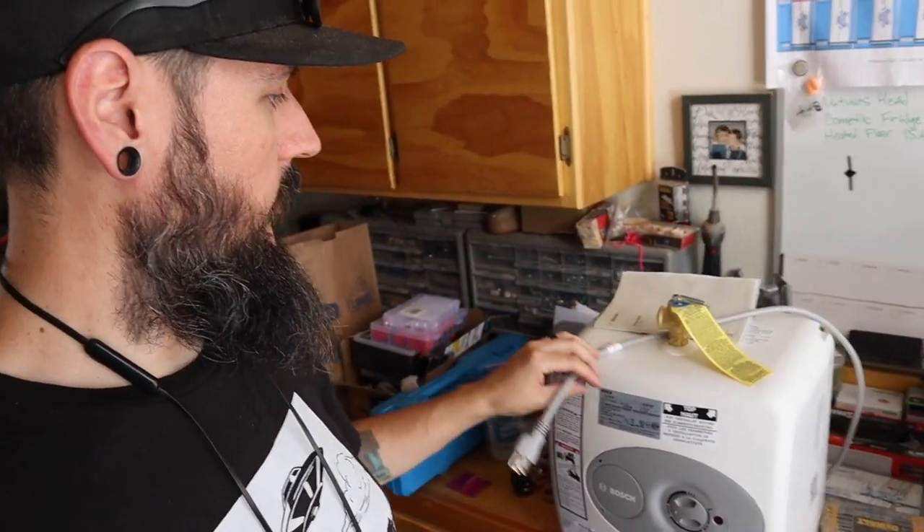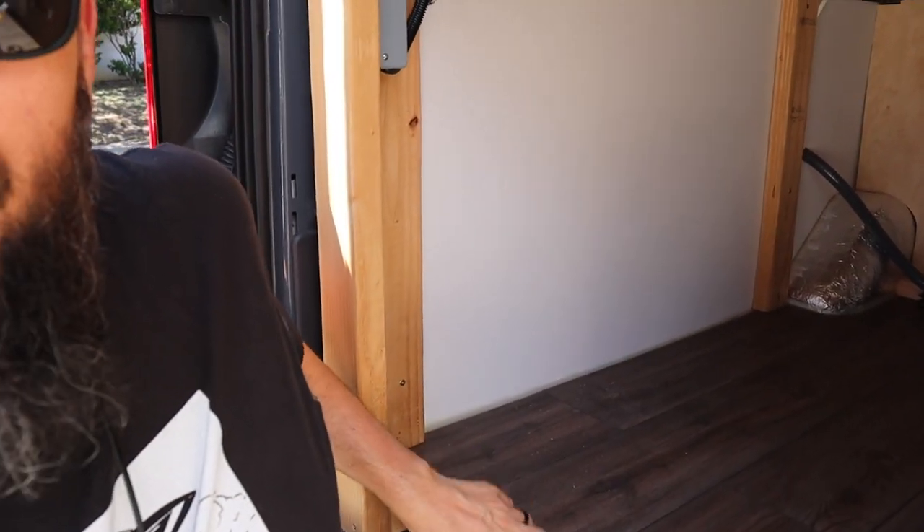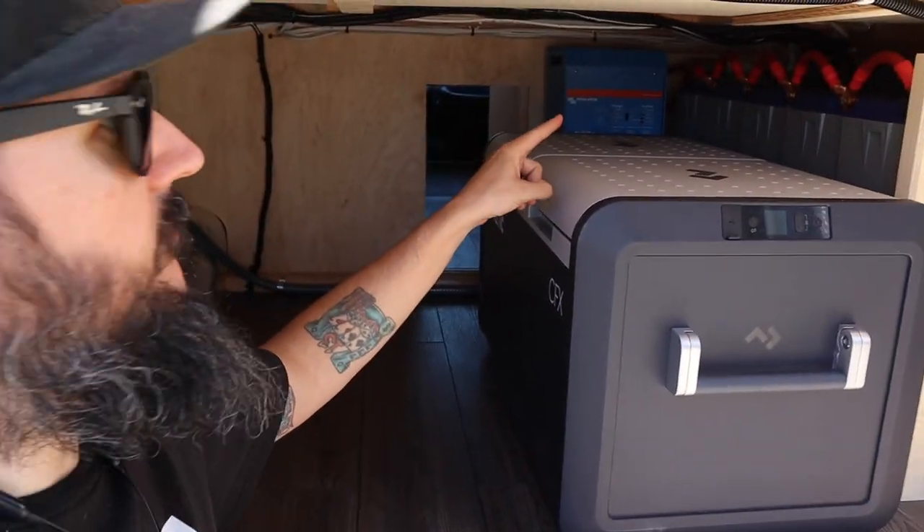The four and two and a half gallon models use a standard outlet. I've already run the wire and have a breaker for it in the van, so I just need to run the outlet to the corner where it'll be plugged in. The eight gallon unfortunately needs to be hardwired. This is the area where I'm going to mount everything for the water system — just across from our electrical, underneath the garage. The tank should fill the space between the wheel well and the front, and right above the tank I'll mount a sheet of plywood where I'll mount the accumulator and the pump.